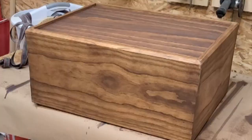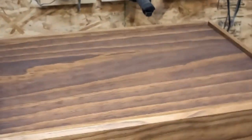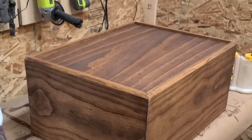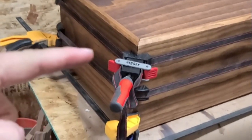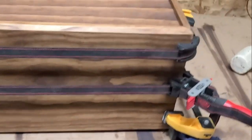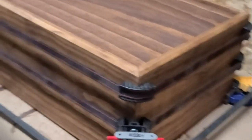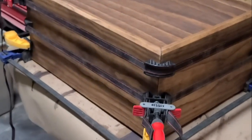Wish me luck! Look how good this thing looks — I don't even have clamps on it yet and everything just kind of snapped together. I'm super happy right now. If you don't have a set of Bessey strap clamps, you need to get some. I need to get some 36-inch bar clamps or pipe clamps because these spring clamps are maxed out at 24 inches. Fortunately most of my shadow boxes are 18 by 24. Everything lined up really nice — this thing is square within a sixteenth of an inch. I'm going to let that glue overnight and then tomorrow we start the hard part.